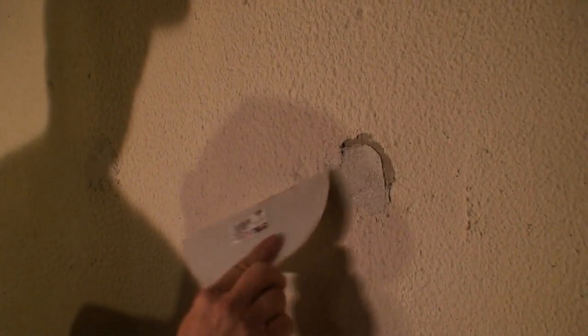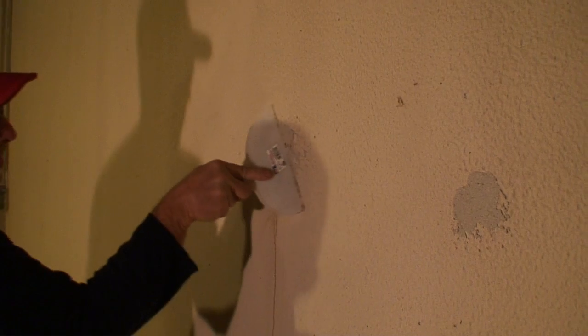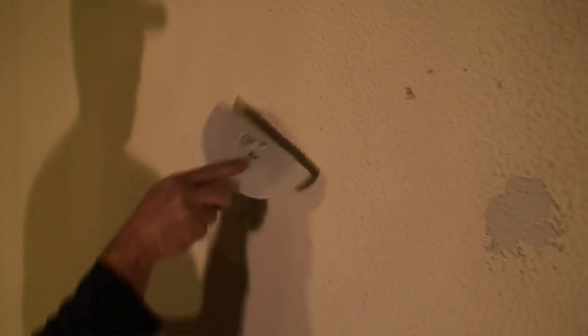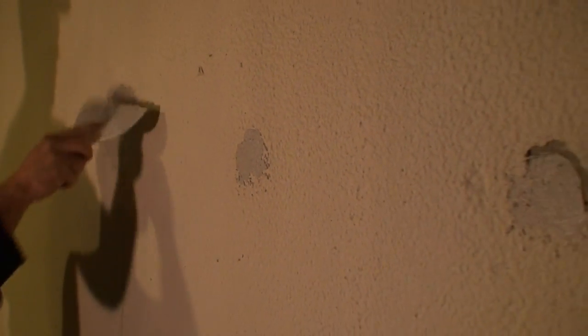After all is done, clean off the surface and apply hydraulic cement or drywall mud to fill in the surface for a paintable finish. It is important to mention the TRX should not be applied in a honeycomb area of concrete, where the aggregate concentration is excessive, causing seepage through that area. Also, you may see a wall fracture. If the rod hole falls within the wall fracture or honeycomb area, they should be sealed separately with injection of water-activated polyurethane.